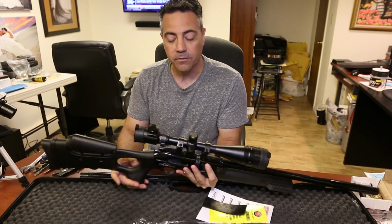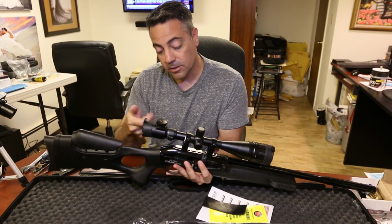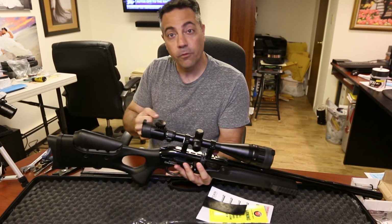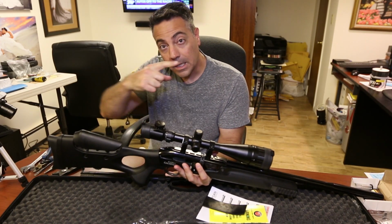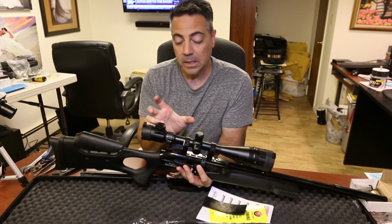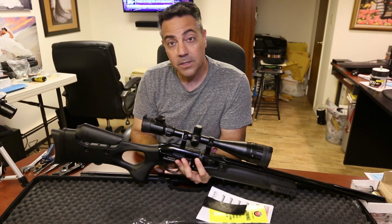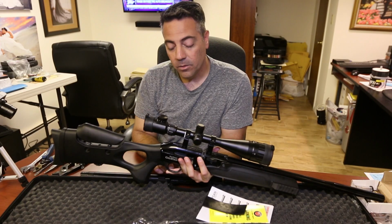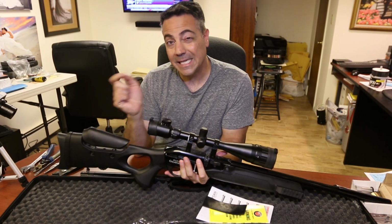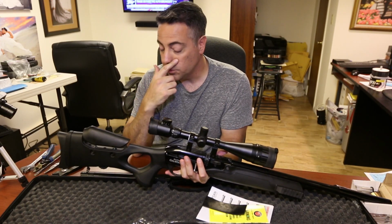And tension, the hammer spring and the tension guide. There's a nut in there that you turn. If you turn counterclockwise, it backs it out, therefore creating more pressure, or clockwise pushes the pin further in, releasing the pressure on the spring and giving you less pressure. So what I did was to lock the nut because it kept moving. I guess too much adjustment made it loose.